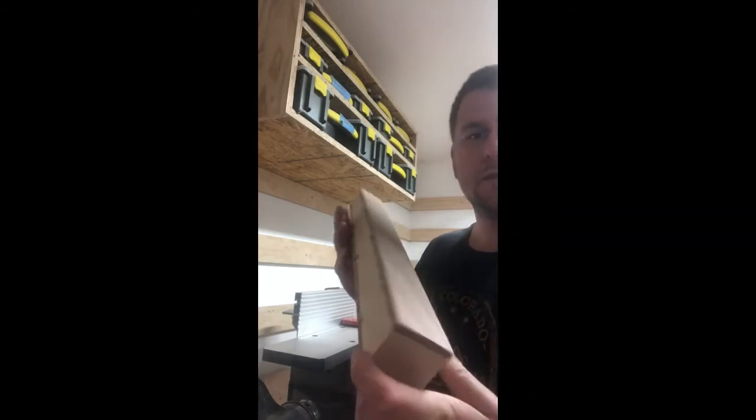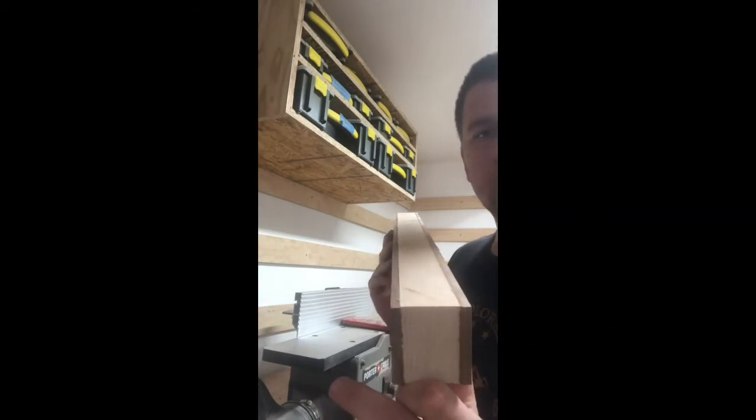Okay, day 2 of this basket we've built. So this is what we got. We got 6 of these. This was the bottom side, the side touching the clamps. And here is my top side. I did scrape it with just a little chisel, probably about 30 to 45 minutes after the glue up. It's hard enough to where you can scrape it, but you're not going to be tearing anything up. And that leaves you with a nice clean side.